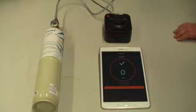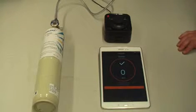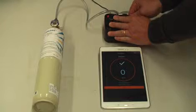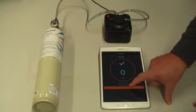We can see here that the first item has passed, zero pass calibration. The next item we need to do is connect the bottle with this tubing here to any side of the sensor. Insert the tube like that and hit next.